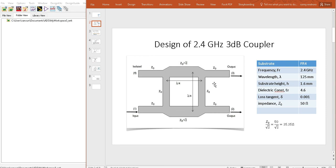At port two, the output voltage will be V1 divided by root two. For port three, because the signal is 90 degrees out of phase, the output is also V1 divided by root two, but it will be on the negative imaginary side — that's why it is represented with a minus j factor, representing the imaginary aspect of the 90-degree phase difference.